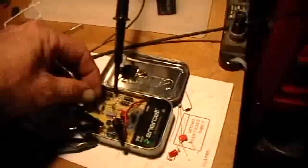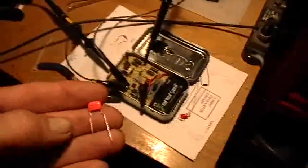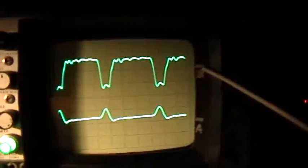Now if I simply take a piece of wire and short across where the zener goes, like this, you see again that it just kills the circuit with zero current and battery voltage shown. Okay. Now here's the interesting thing. This is a 0.01 microfarad capacitor. So remember where the zero current baseline is. A little bit more light on the screen there. Zero current baseline is right there, and it's marked by that little marker right there.